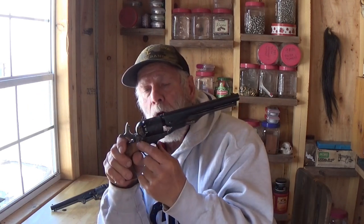And this particular gun, the only movement is whatever that tolerance is between the hammer and the bolt that holds it in place. You also have to bear in mind that your bolt has those two dog legs. Part of that bolt also operates in keeping your hammer tight. Look at the way that goes in there, and look at how it rides up against the opposite wall as it rides on the hammer. So that's also designed, as weak as they are, I will have to admit that, because they are a weak point in these revolvers. Okay?